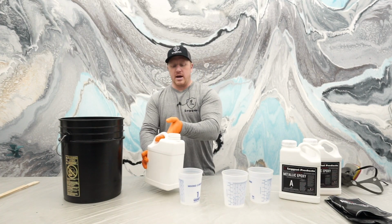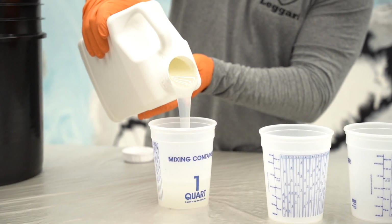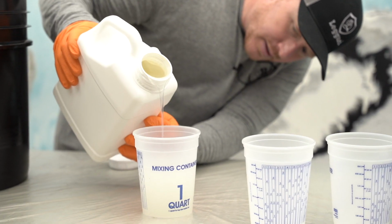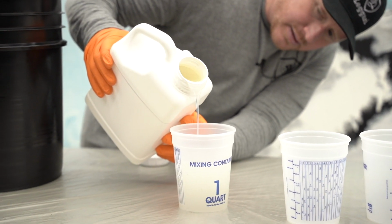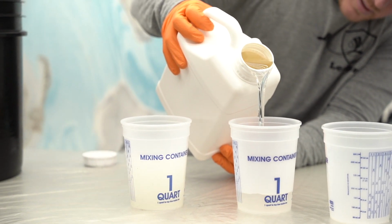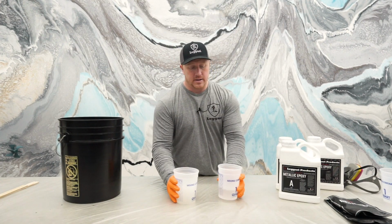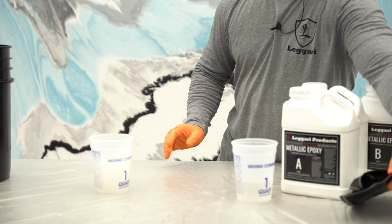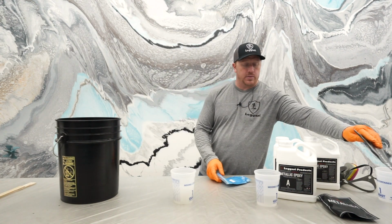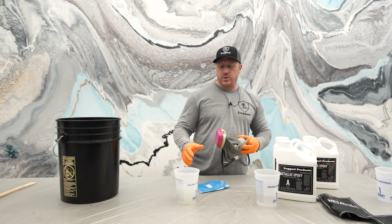I'm going to pour out 20 ounces of my part A. Because it's 2 to 1, then I'm going to separate 10 ounces of my part B. Again, I'm just separating some part B and some part A for the highlights. Right here, I got my part A, I got my part B, and now what we always teach is that we're gonna take the metallics, and we're actually going to put the highlight metallics into the part A. I'm gonna put a respirator on because we don't want to breathe the metallic dust.